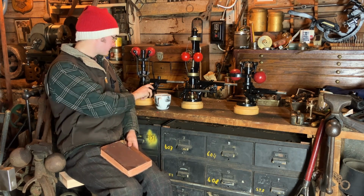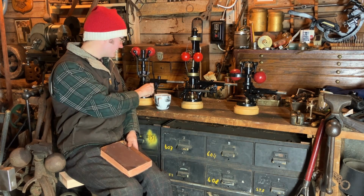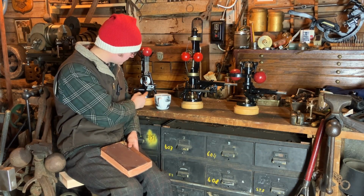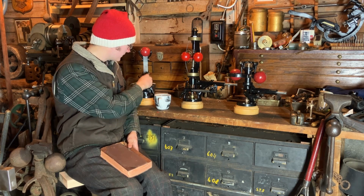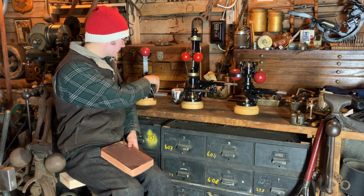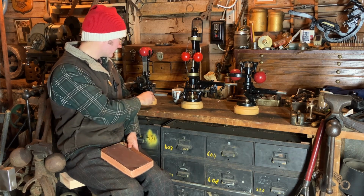So on the Gardner, we have a wheel with a jam nut, and this applies more or less force to a spring inside the casting. And the spring puts force on this shaft here, which has this big arm. This arm is called the Sawyer's lever, or often referred to as that. Maybe there's a more technical term, but this is the Sawyer's lever.